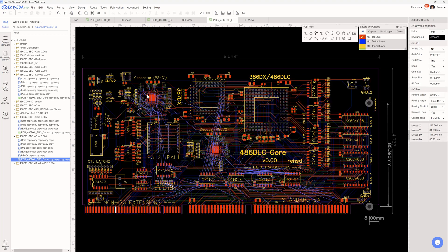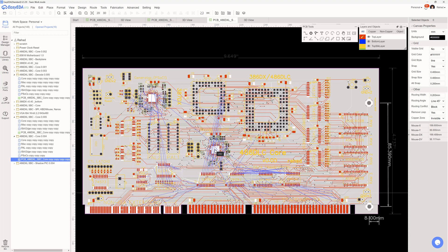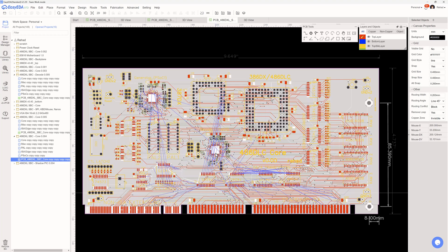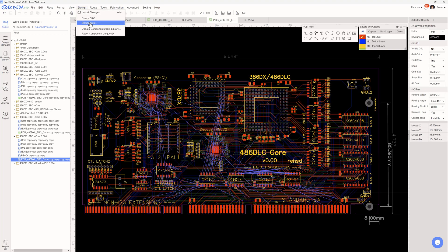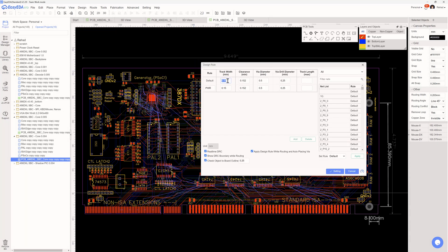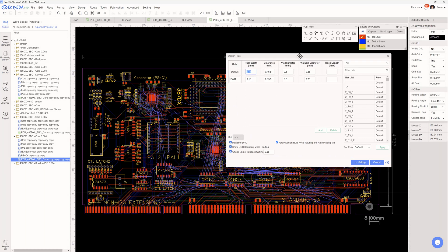For example, putting the PSOC directly on the PCB is something I haven't done before, so there's risk that the design doesn't work or that it's difficult to actually get the solder on as I move forward. I've also been experimenting with trace width — right now I'm using 0.15mm and I shrunk the via down a little bit, so I'll experiment to see if that causes any problems.